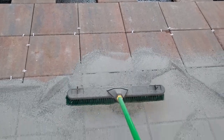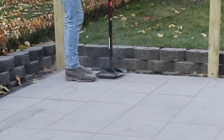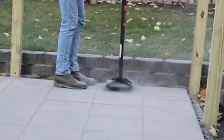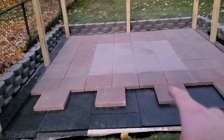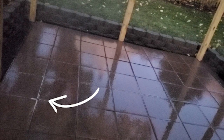But as you can see, when you brush the polymeric sand across very porous concrete pavers, they turned very, very gray. So I was super nervous about a grout haze, and that's where I went the most wrong. I did outfit our tamper with a piece of paver panel — I thought that was pretty clever, and it worked well to tamp down the concrete. What I was trying to communicate is that I did a very thorough job of leaf blowing, which I realized was way too much because it actually blew some of the polymeric sand out of the joints. And I did not need to use this much water — on the box it says if you see any foaming, stop. That's foaming. You don't want that. But I kept going.